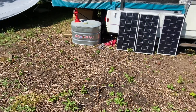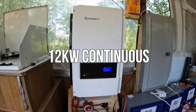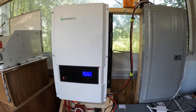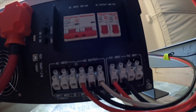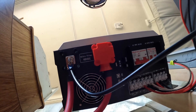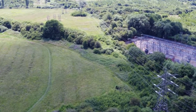It can input 120 amps of solar, which is absolutely massive. To give you some perspective, I have six brand new 100-watt Renogy solar panels and when they're all in direct summer sun, I get about six amps of input. It can output 12 kilowatts continuous and 36 kilowatts of surge, so it's a powerful machine and probably overbuilt for my 20 by 40 cabin. Growatt lists this inverter for use in a large residential or small industrial setting. You can definitely use this machine while connected to the grid in pass-through mode, where the grid power would simply pass through the inverter and power the house.